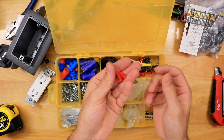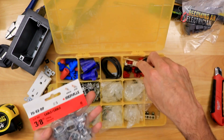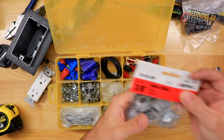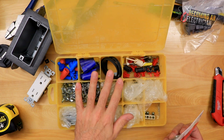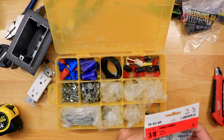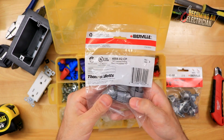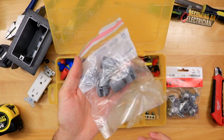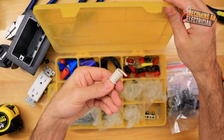From the last video when I talked about anti-shorts — I'd also make sure to throw in some L16s, these are just single connectors. I'd make sure to have at least two or three of those at all times, plus one double just in case. Always think about weight, because this bag can get heavy, so maybe just two singles and one double. Same with what we call 4040s — sometimes called 4004s — on job sites. These are really light so I'd stock up on these. They're really useful to have if you're doing a lot of residential or condo work.